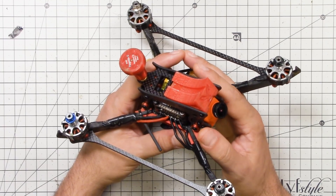When I originally went to go fly it, there was some really weird ticking in the motors — gyro noise is what that usually is. As I went to throttle up, the copter tried to fly away and didn't throttle down when I went to throttle down. Something just wasn't right, and I never did figure out what the problem was. I suspected the ESCs: it turned out I had BLHeli Wraith ESCs that were pre-production samples sent by a vendor — locked out of BLHeli completely. I couldn't change anything, not even the motor direction, never mind flash new firmware.